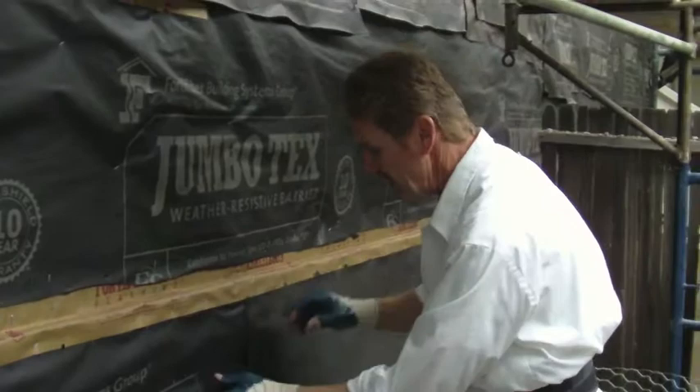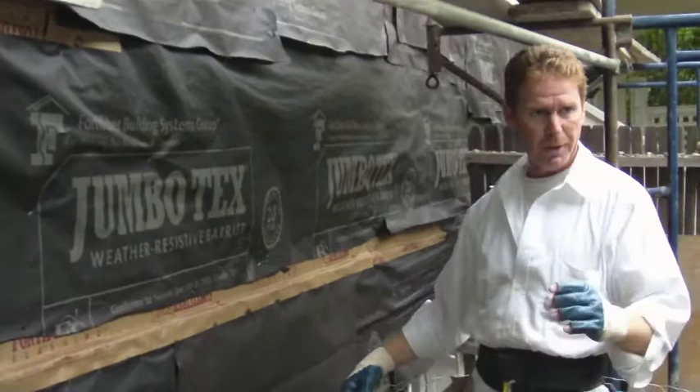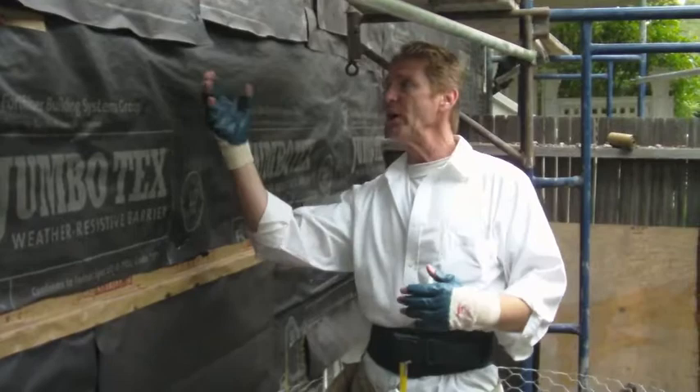What I also want to do today is wire the paper, because it's been here a couple of weeks now. We're in Alameda, a low spot, but in some areas the wind is so strong it'll vibrate the paper and pull these little hammer tack staples loose, creating leaks.